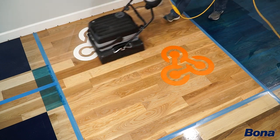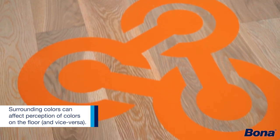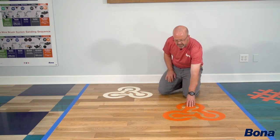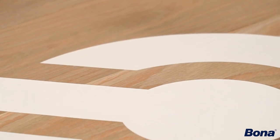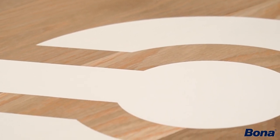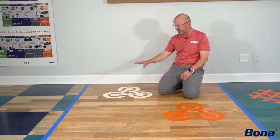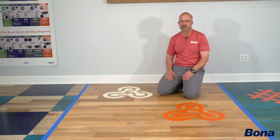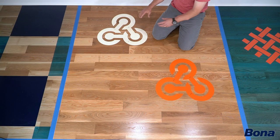Also, how do the surrounding colors — whether colors on my floor or colors on the wall — affect how the colors might look on the floor? This looks really nice and orange to me, and it might look nice and white to you on film, but from where I sit there's definitely an orange cast to it. We know it's not coming up from underneath because the stain was fully dry with a couple coats of sealer on there — we've got plenty of white paint on there, but all this surrounding orange gives it a definite orangish hue.